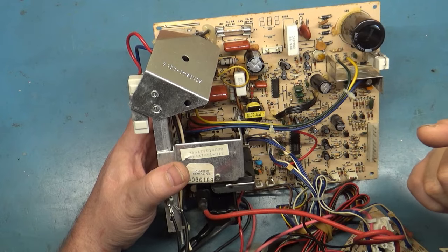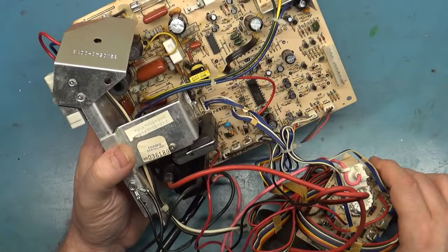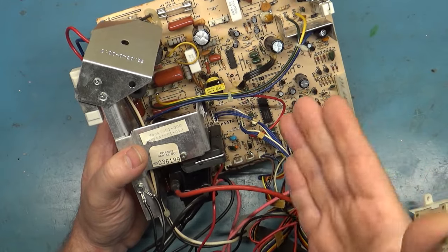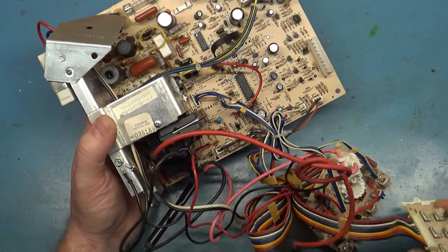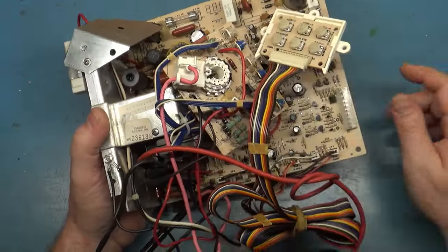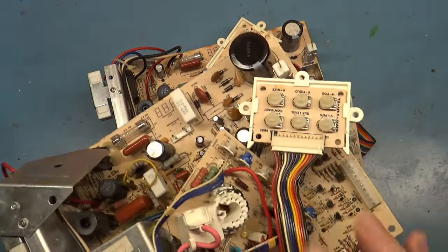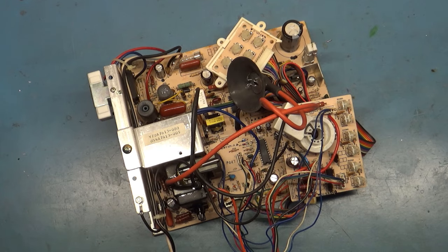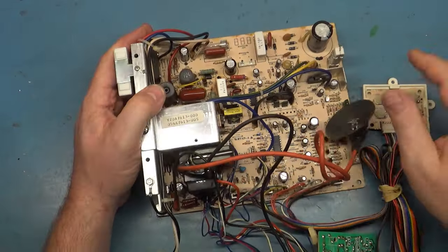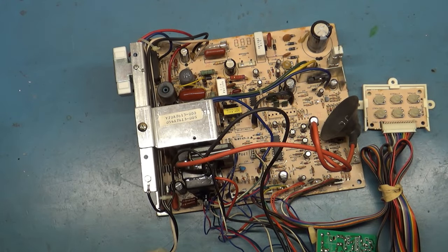However, in an attempt to verify that the tube isn't causing the all blue screen with retrace lines, I hooked this up to the same tube, and on my tube I don't get an image at all. I get heater glow, it turns on, I get high voltage, but absolutely no image — flyback maxed out, brightness and contrast maxed out, color pots maxed out. The same test tube that gives the all blue screen with retrace lines using the other chassis. So we may do a separate video with this one. For this video, we're going to figure out why I'm getting the all blue screen with the retrace lines. I know the tube isn't the cause of our problem.